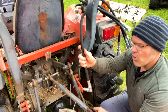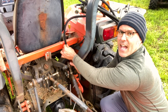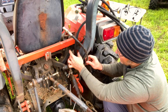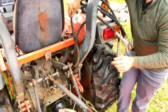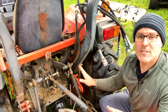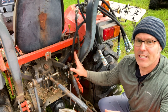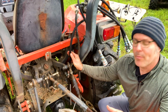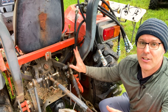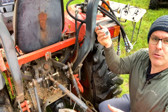I've connected the hose with the male coupler from the spool valve and I'll zip tie that up out of the way. The backhoe return line is long enough to come right up here and connect directly to the return port of the spool valve. I love to put 90-degree fittings here to get the hose up out of the way. This is now plugged into the tractor — as soon as the tractor is on, you can have power by moving those levers.